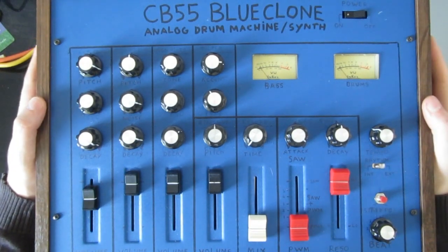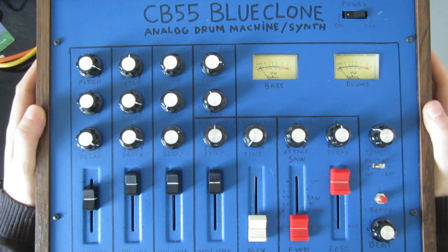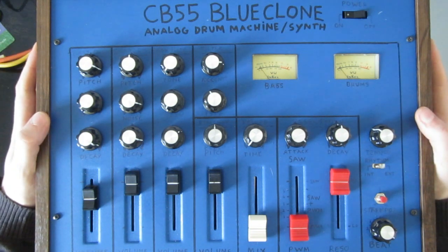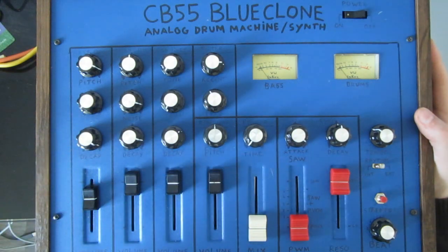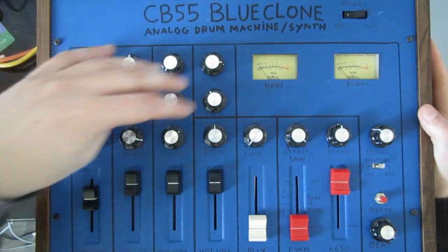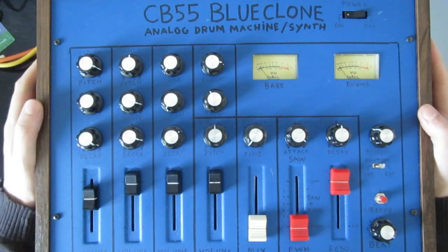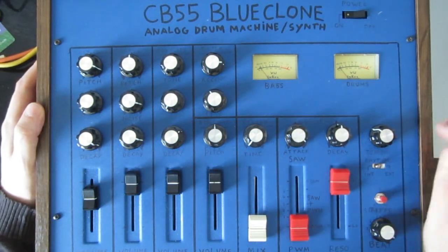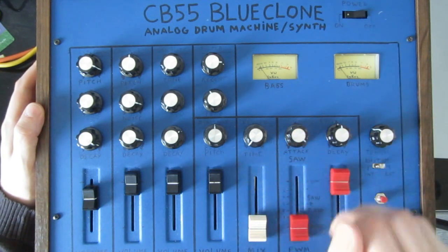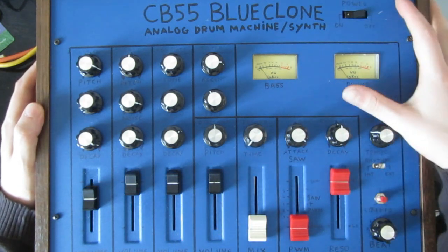This is the Blue Clone — my analog drum machine and bass synthesizer in one. This is my latest creation and I'm quite happy with it. It's an analog drum machine based on the CB55 by Circuitbenders in the UK, which is a clone of the Roland DR55 — a pretty cool drum machine. I added a whole load of extra functionality, which are all these knobs, which I'm going to talk about later. It also has an analog bass synthesizer, which is digitally controlled, so it's a DCO. It also has a VCF in there, and it's a prototype for the voice boards for DRADEK, which is my next project.